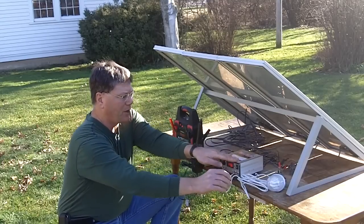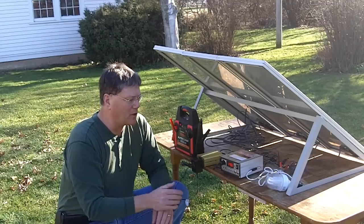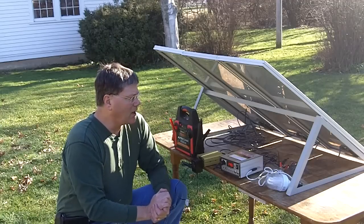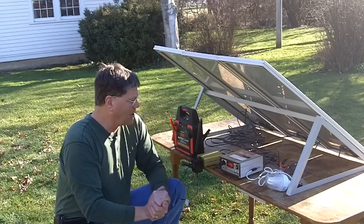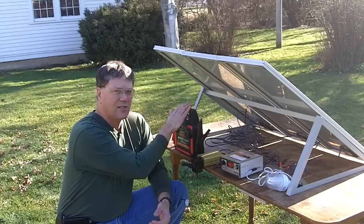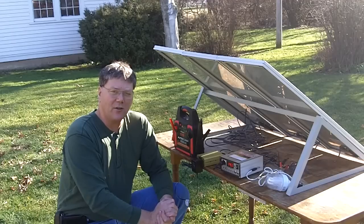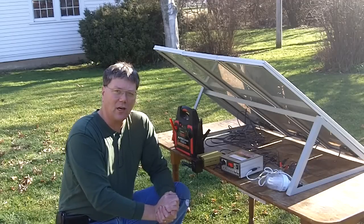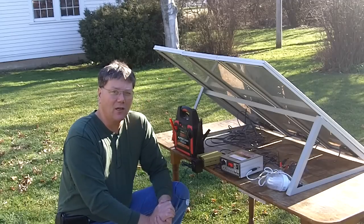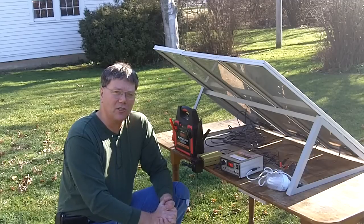I also have this battery pack charging via a 300-watt transformer — it seemed like the logical way of getting the current into this battery pack. It says it's a 300-amp start power, but from the specs this is basically a 7 to 8 amp-hour battery. I had a 13-watt fluorescent light on it the other night and this battery lasted about four — could have gone five — hours powering a lamp. That's my whole setup initially, just to get a couple of lights off a battery.